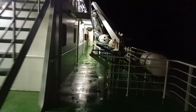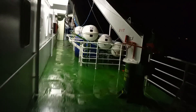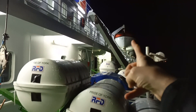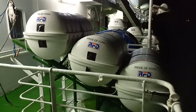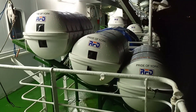When you board a ship, familiarize yourself with the safety systems on board. It is highly likely that a controlled evacuation would make use of these large closed-capacity lifeboats, which are to be operated only by skilled crew. However, in the event of an unforeseen emergency, these self-contained life rafts may be your only option and it is up to you to know how to use them.